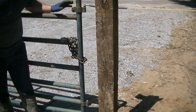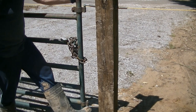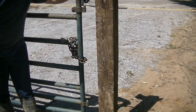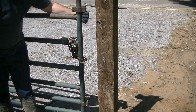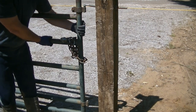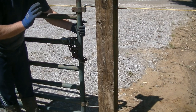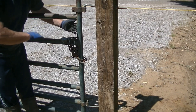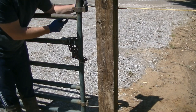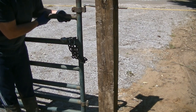I want everyone to see this: when you're mounting your gate to your post, you can see you've got your hinges. The top hinge should be pointing down. If your top hinge points up, yes it swings and operates properly, but someone can just come over and lift it up and open your gate and get access. Also your livestock - horses and cows are very, very strong - they can get their head in here and lift up and take it right off the hinges. So you want to make sure you put your top hinge pointed down, and that will secure your gate to the post.